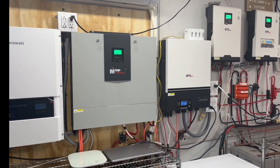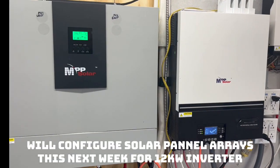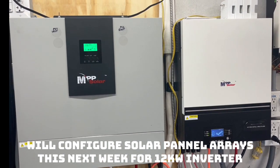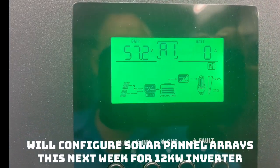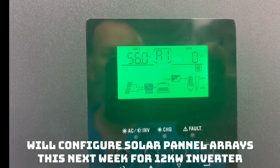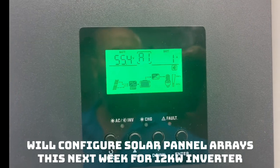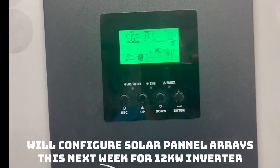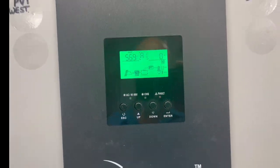When I'm running stuff during the day on these two 48 volt systems - my mini splits, my pool pump, my pool heater - my battery bank stays way up there. It doesn't get below 53 volts all day long while I'm running three to four thousand watts, 50 amps worth of current running through these things.